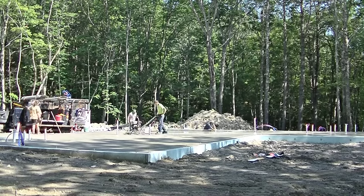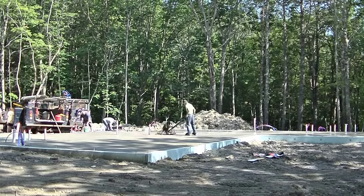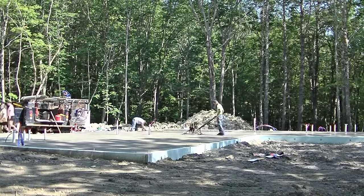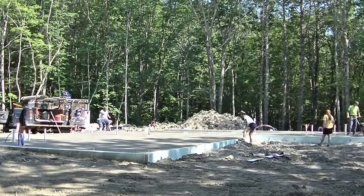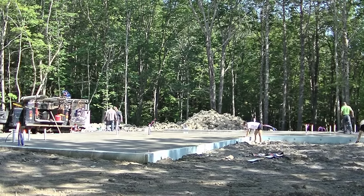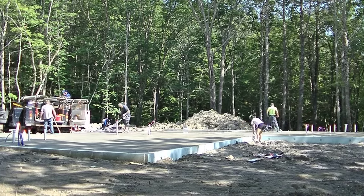we call it floating the concrete. The first pass like this is we call it floating. Now you guys out there that power trowel a lot of concrete floors, chime in here down in the comments and let these guys know your terminology too about what you call this. But our first pass, we call it floating the concrete. And then the next pass is after this, we call it hitting it with the finish blade, so finishing. So we have a float pass and then our finish passes.